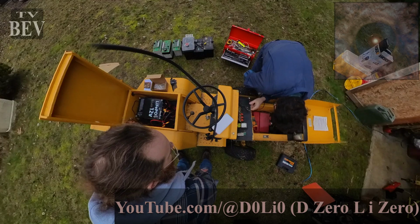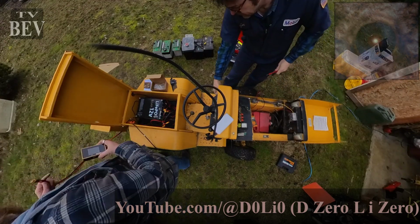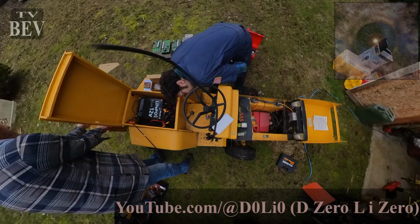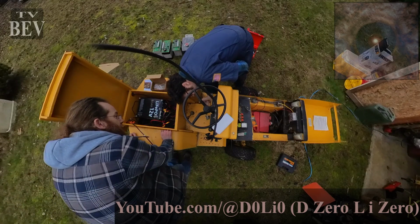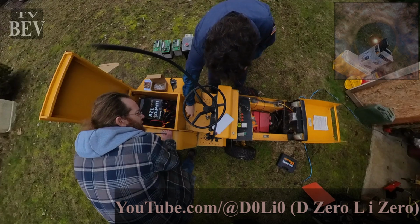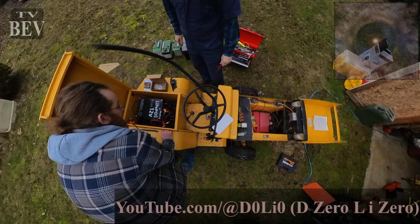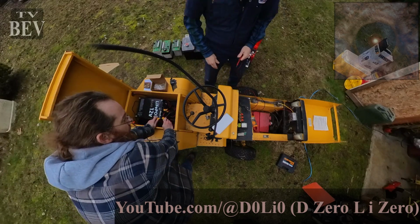Oh, was that just a continuity test you just did? Yes. On this continuity test on the switch, make sure that this is up and down. Now, we have one stray connector here, but it's not going to ground out against anything. Do you know what that was for? No. Okay. I've got no fuses on this. Okay. You ready to light it up? Let us light.